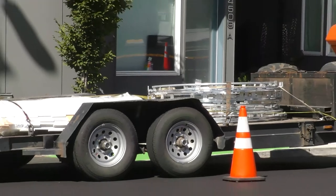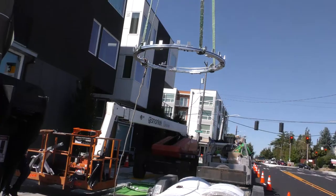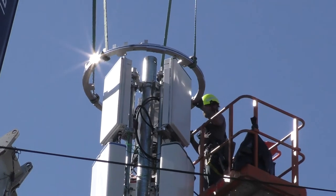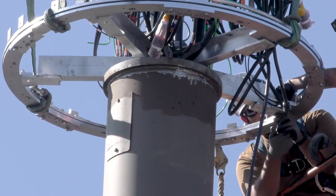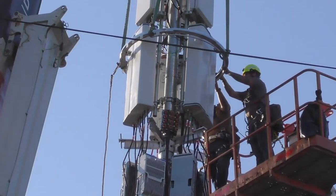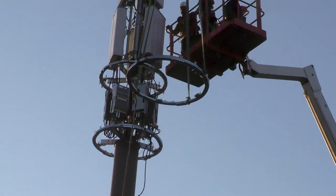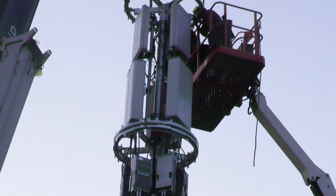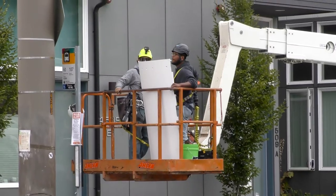There were four rings for this site, and each one was hoisted up and carefully guided down over the new mast, then bolted onto the collar mounts. There's a top and bottom ring for each of the two sections — one fixed and one rotating — and once those were all in place, we brought up the special fiberglass panels.